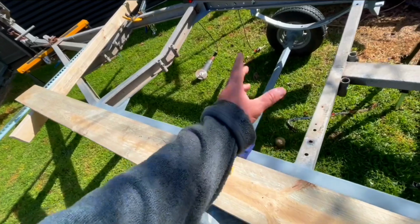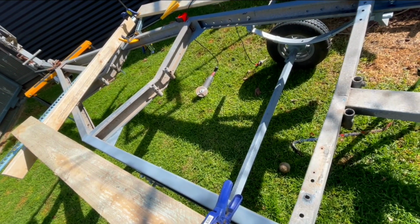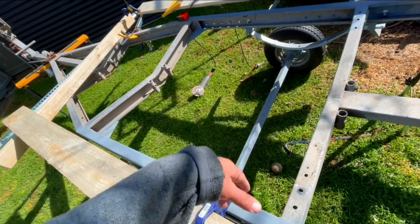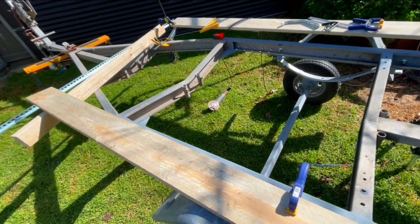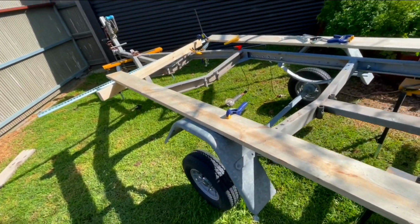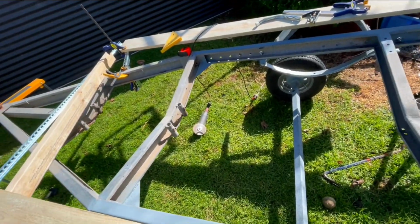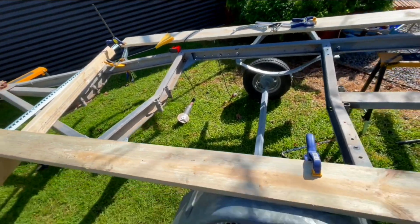Yes, I did all the axle, and you probably saw all that on the earlier footage, but new bearings, new caps, new seals, ground all of the axle back, ground all the rust off the hubs, and rust treated the whole thing, and then galvanized painted it as well. So hopefully that keeps it alive for a bit longer.